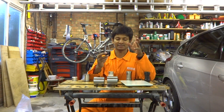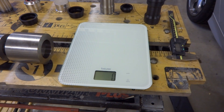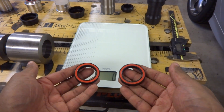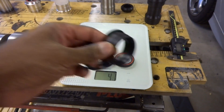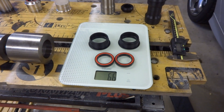Let's look at system weight. For system weight we have two 6806 bearings, which are the same as for BB30, so they're instantly 41 grams. Now instead of circlips we've got plastic cups, so our system weight is 66 grams — slightly more than for BB30.